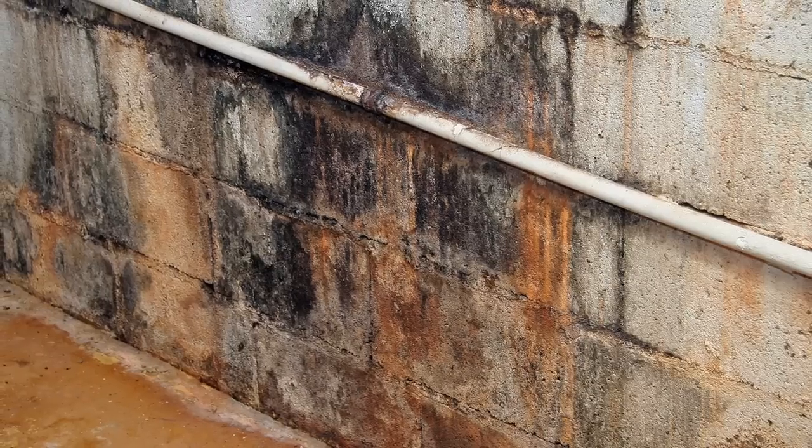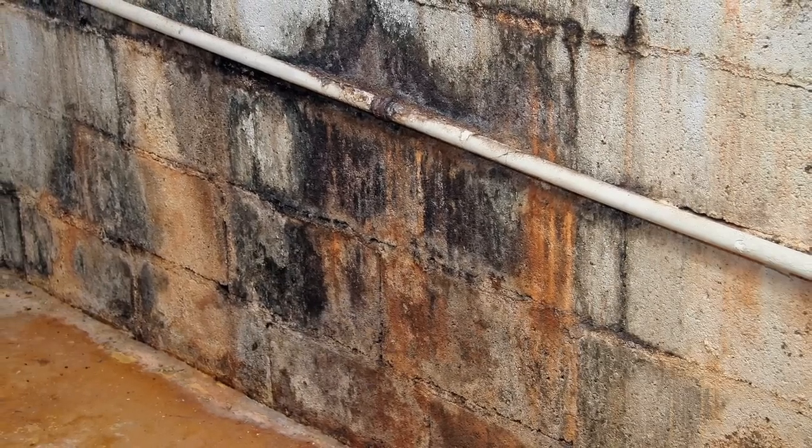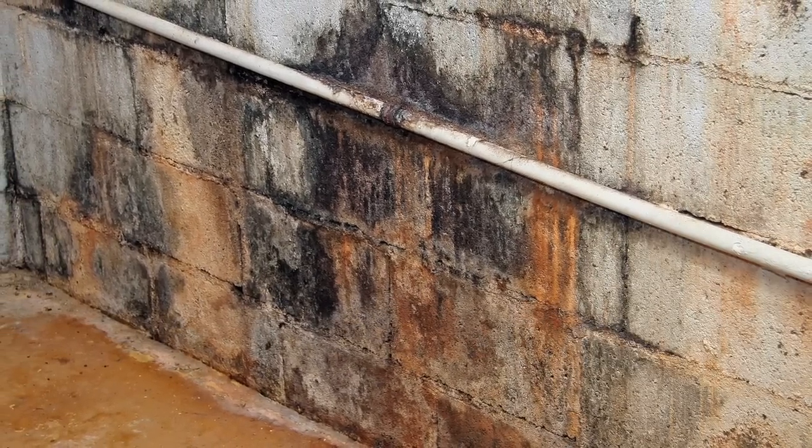Basements are especially susceptible to water vapor infiltration through masonry walls and floors, but ventilation is not always the answer. Only ventilate basements when outdoor air is cooler than the air inside your basement. Basement ventilation during hot, humid weather only actually encourages mold growth.